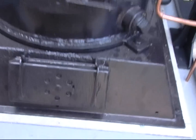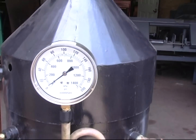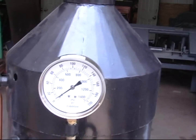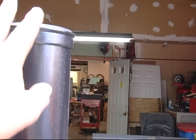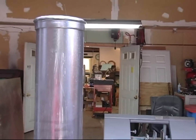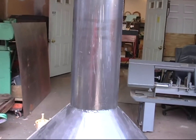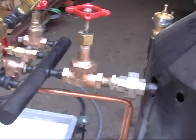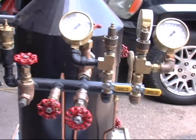If you wanted to run off coal, this is where the ashes would go — we have nothing on the bottom to catch them because we don't need it right now. This is the main pressure gauge. Someday I'll make a little brass cover flare for it when I get time. This is the stack we made — the top piece was the top of a fence post, cut off the point, rolled out of steel. There's a ring around the inside top of the boiler stack as a dry pipe, and it comes out right here.